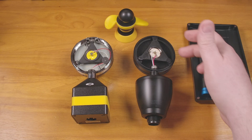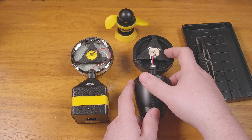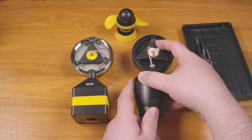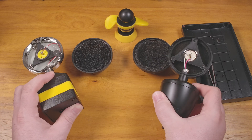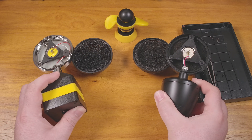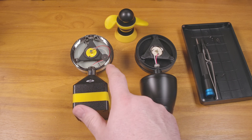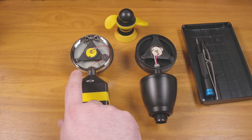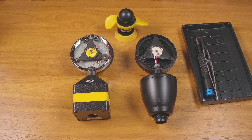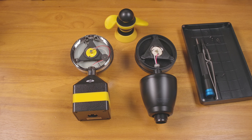The capsule on both microphones is mounted in a trilobal rubber mount, and the one on the new microphone is slightly thicker. Inside the rear grilles of both, it's just an open cell, large cell foam — pretty much the same on both. But inside the front grille, in front of the capsule, they're quite different. On the new microphone it's a fine mesh foam, but on the old microphone it's actually a very fine metal screen. I can't say either is definitely better or worse — they're just different. The older design was probably a little more expensive to manufacture, but whether that translates to better practical performance, I don't know.